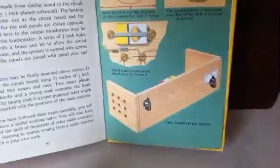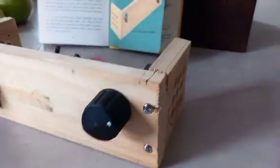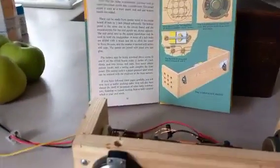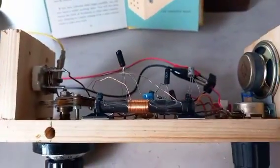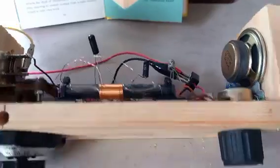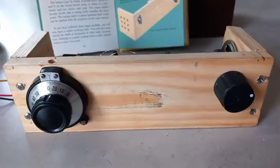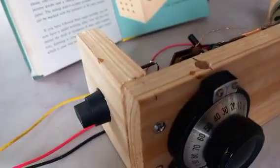As you can see from this picture, the first thing you'd notice is mine is reversed because I'm left-handed, so my speaker is on this side. The other difference is the tuning control — it's literally half a wrist turn to move the tuning capacitor from one end to the other, which is far too quick. I discovered that as a youngster. Vernier dials give you lots and lots of turns, graduated zero to a hundred, giving you a tuning scale — but they were very expensive back then and still are now.